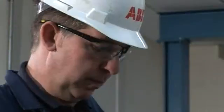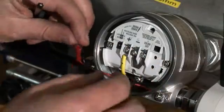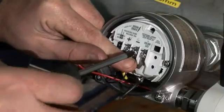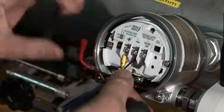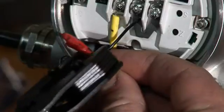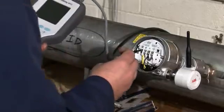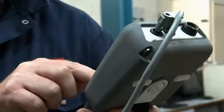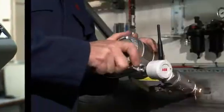One of the signal wires of the instrument is then disconnected and the adapter's wires are connected in series. The adapter and signal wires are then simply crimped together. As the adapter draws its power from the loop, no additional batteries or power connections are required. Next, we connect a HART handheld configurator, which is used to tell the adapter which network to join and provide it with the password to allow it to do so. The handheld configurator will show the status of the network joining procedure.